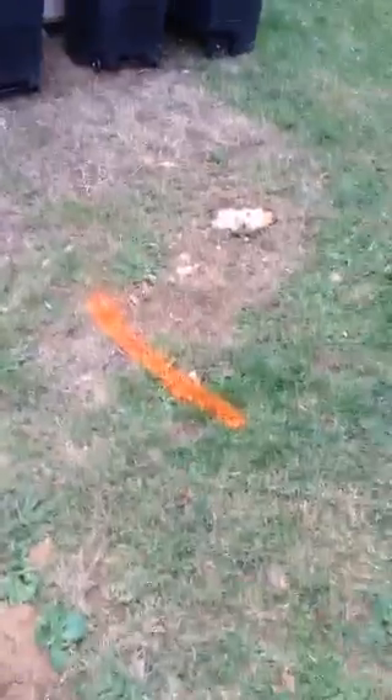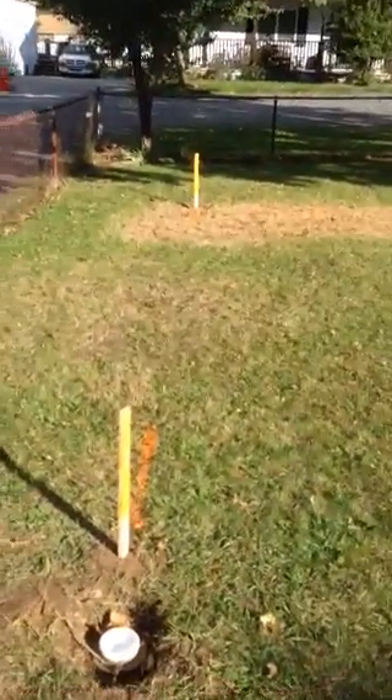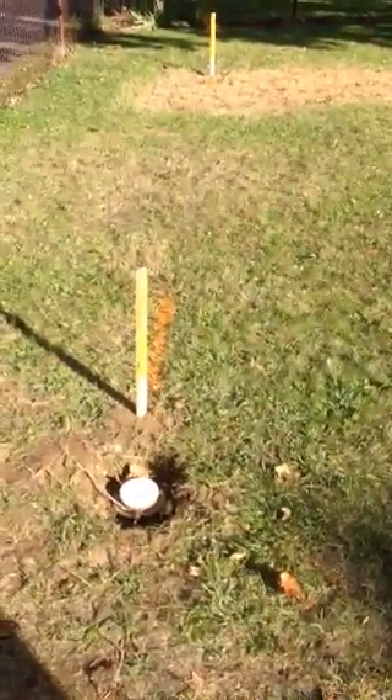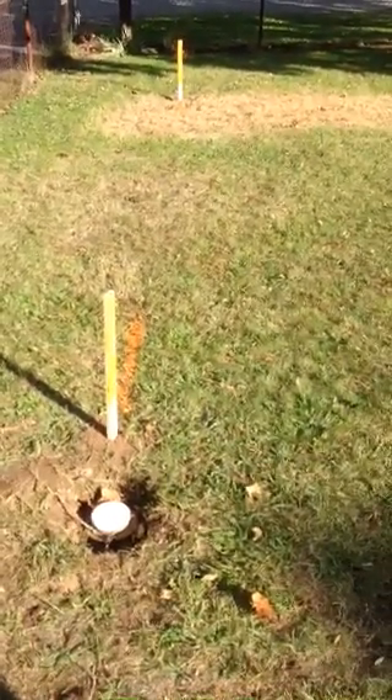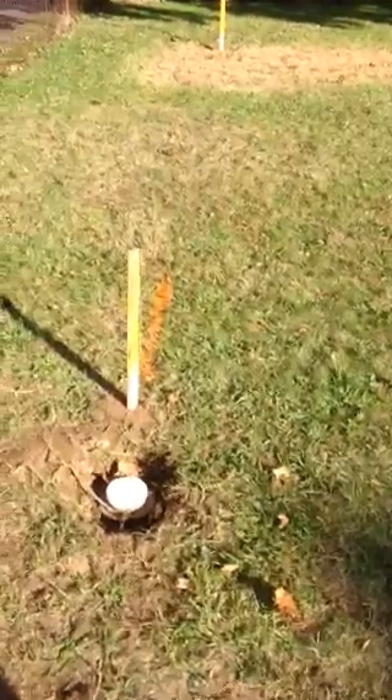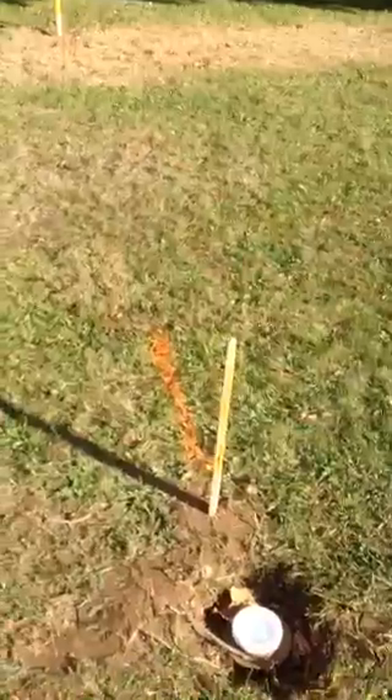From here, we'll need to pull under the shed. Basically from this stake to that stake, there is a huge belly — that's really what's causing the problem. So we'll have to dig this up. We won't be able to pull it. There'll be a couple places we're going to have to dig, and a couple places we're going to have to pull.